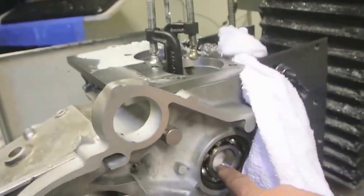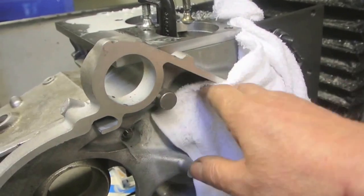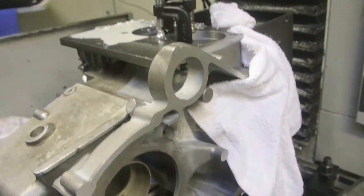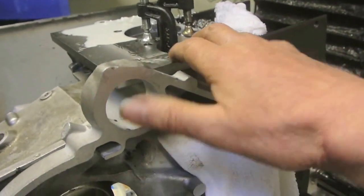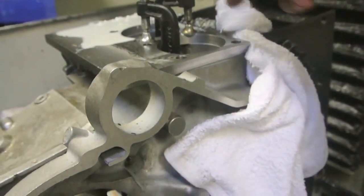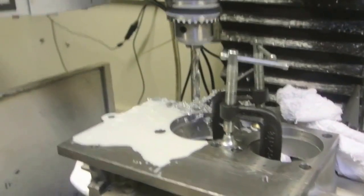The reason that was difficult was because I haven't got the dummy shaft to fit in here. However, now that the bearings are fitted that's more or less obsolete. What I did was set this up once I got it flat so it ran parallel along this face and along the X face. So that was the setup — quite an elaborate setup really.